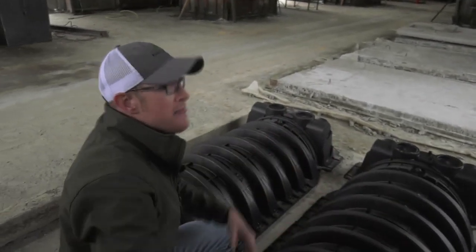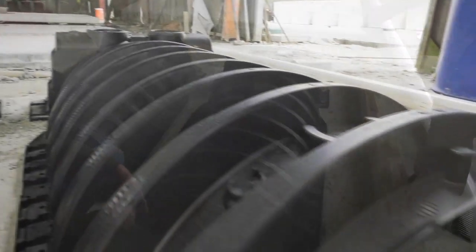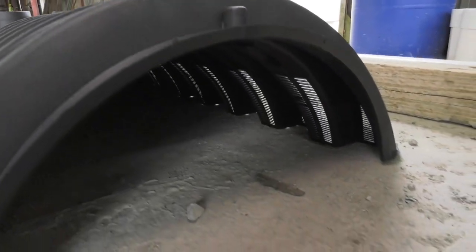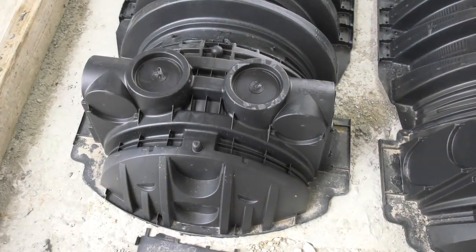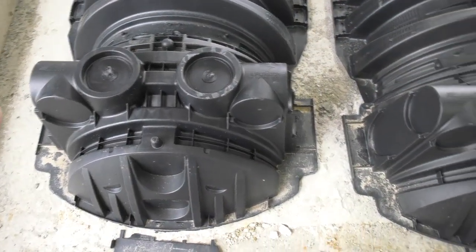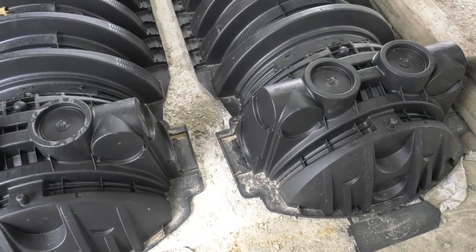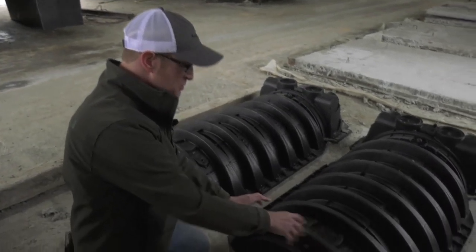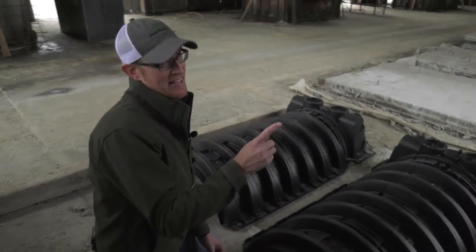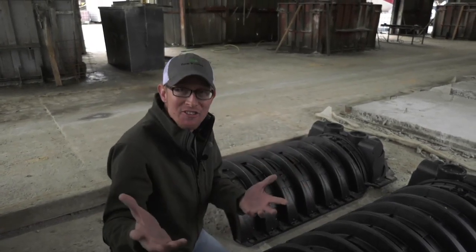Well, yeah, and as I mentioned before, the depth of the water table determines the depth of this product. A deeper soil profile like North Georgia, this thing might be 4 foot in the ground, whereas down here in our part, or even further in South Georgia, this thing may be a lot shallower. Interesting. And it's got the filter system on the side. Finally, I've got to ask you about some of the ways that we can maintain a septic tank and how extension can help with that.